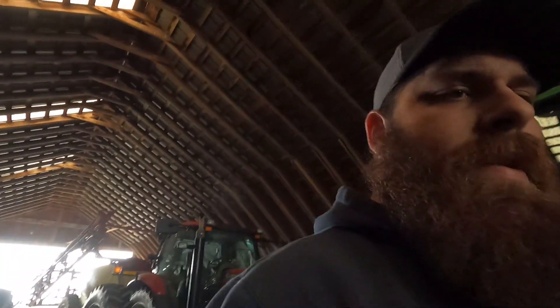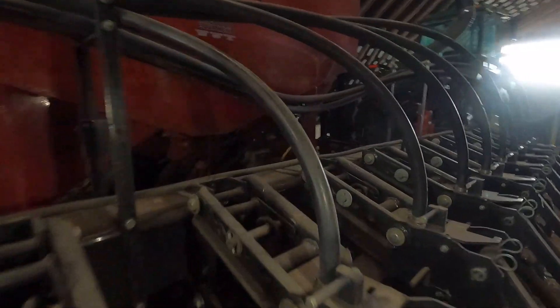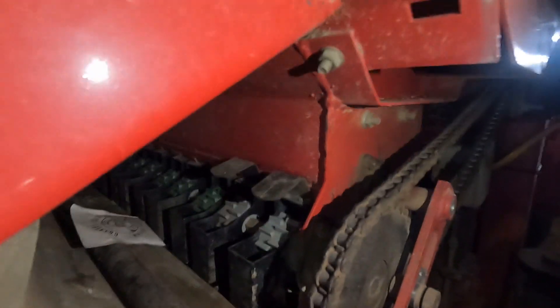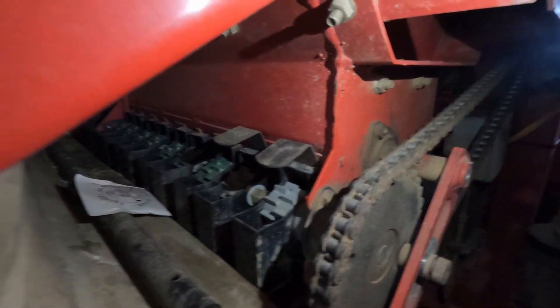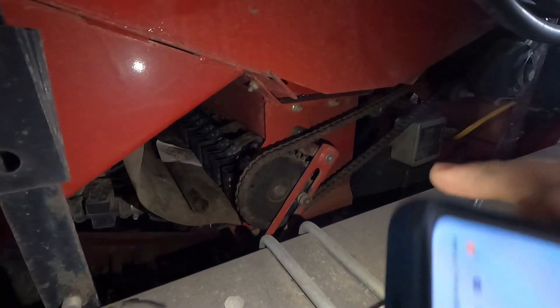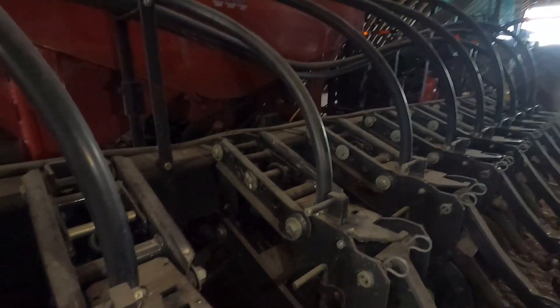And I will show you how the soybean planter meters. But yeah, this is at the bottom of the box here. There's little — looks like gears. And they are — the soybeans fit in between those teeth right there. And however fast that gear right there is turning is how many seeds are coming out the back. And then there's air blowing through the front — it'll push the seeds. There's air pushing underneath those cups, and that falls into those tubes right there. And the tubes go to every row unit.